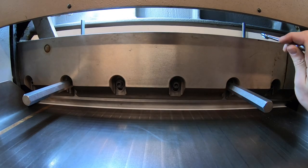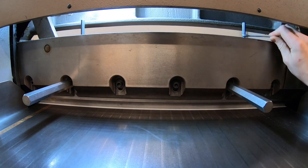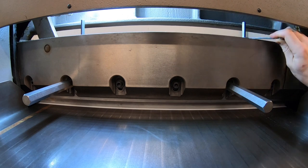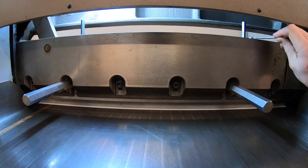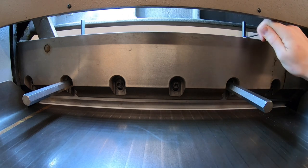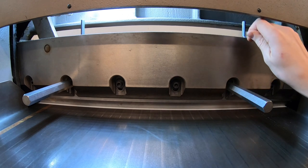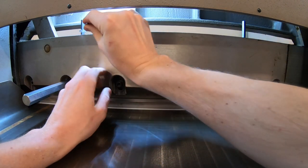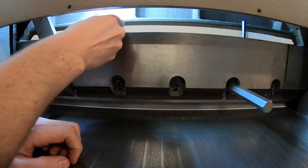What you're going to want to do next is raise these two bolts up — go counter-clockwise all the way up. What this does is raise up the adjustment for the knife depth. If you don't do this and the next blade you put on is longer than the blade currently on your cutter, you will damage that blade and possibly ruin it, and it would need to be resharpened. So move both of these up all the way.